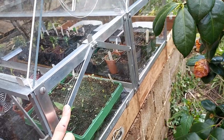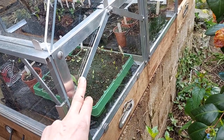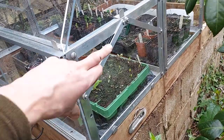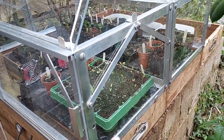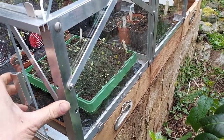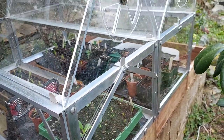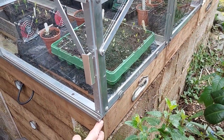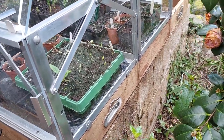When you design anything you've got to source materials. On this one I've got 16mm by 3mm flat aluminium strip, about seven pounds a metre. I was also thinking of using these as little alpine houses - just taking out the glazing completely - but with the glazing in, it makes it really sturdy, keeps it square, and stops it from racking sideways. This timber is old hardwood Iroko from old school science lab benches, repurposed.